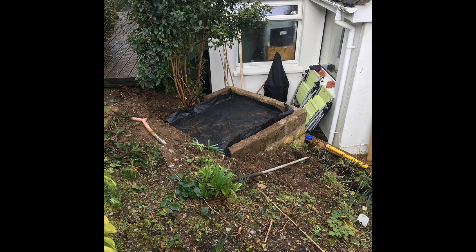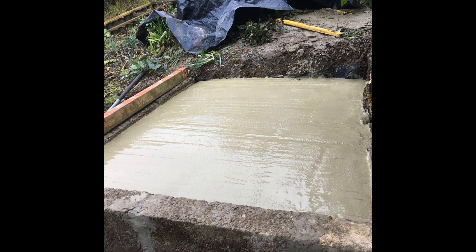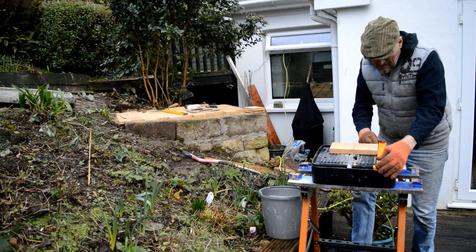I had an area picked out in the garden that had been left from something the previous owner had done. I laid a membrane down — a damp proof membrane — and then a layer of bottles for insulation, and then about 20mm of standard cement. That left me enough to put another 20mm of silica sand and then the fire clay tiles that I bought again off eBay.